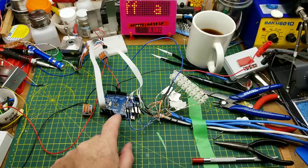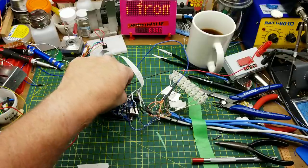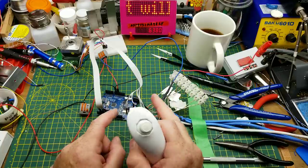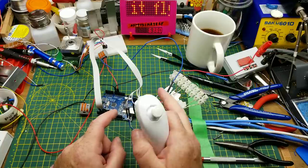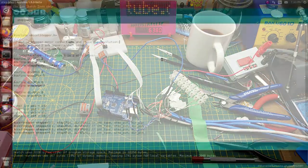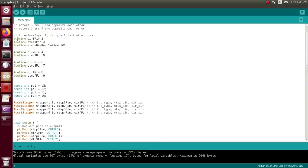I've assigned the Teenage Code Monkey the part where Wii Nunchuck commands are interpreted and translated into stepper motion to make the camera move around properly. But for now I think I can manage some sample test code. I spent far more time than I care to admit throwing this code together just to test all four stepper motors and make sure they work in their physical positions. I'm using the AccelStepper library, which lets you give the stepper motor driver fairly basic commands and have them just go do their thing without worrying about timing. I've defined basically eight pins on the Arduino — a direction and a step pin for each of the four stepper motors. Just to control it temporarily, I've defined four push buttons.